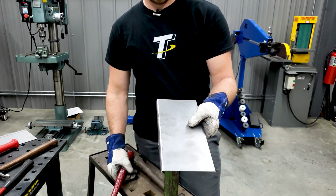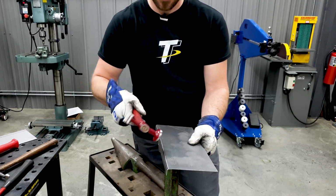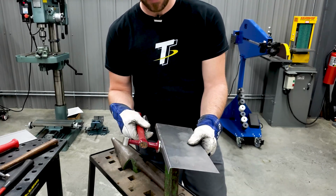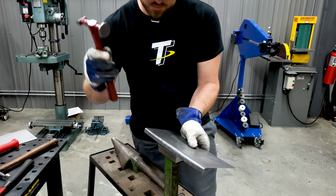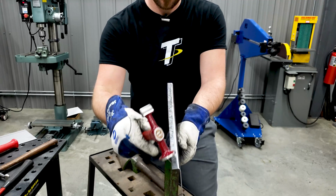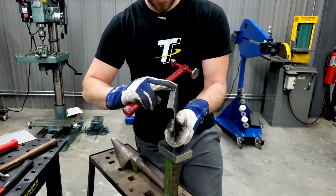All right, so there's that flange. So you can see, when you're doing it like this, aside from going back and forth on both sides, it's hard to get a super crisp edge. You're always going to have more of a roll action in the new flange that you've tipped. But as you can see, I was trying to bend that pretty hard over, and you can see how rough the edge of this panel is. It's got some marking in there, and it's fairly flat now because I hammered it this way, but it's got some roughness to it.